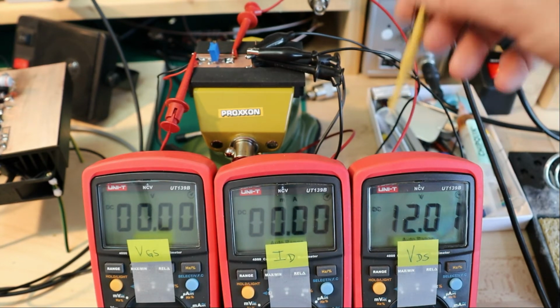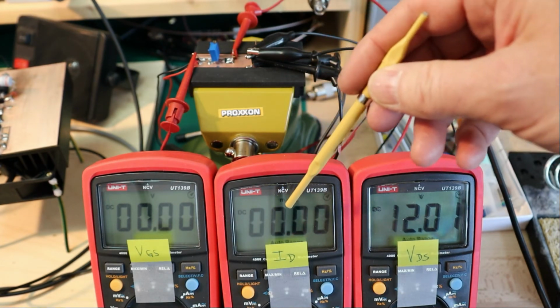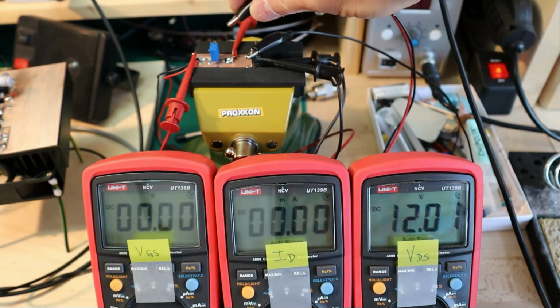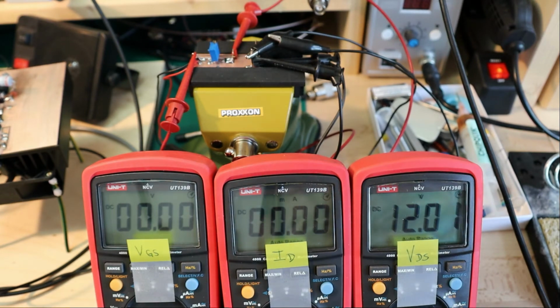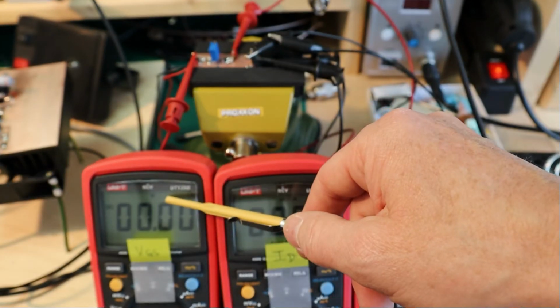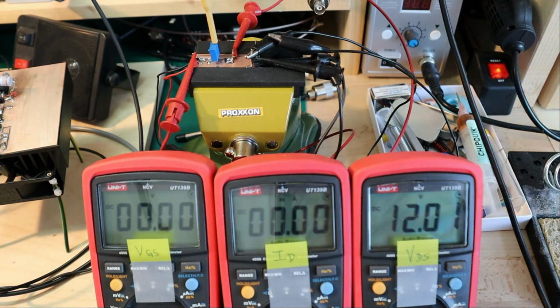I just quickly turn on and immediately have to turn off again, and we measure the maximum ID current, which is specified, I thought, somewhere between 24 to 60 milliamps. So let's see where this current goes. I quickly connect, and it goes to around 30-31 milliamps. Immediately it starts dropping because it heats up so quickly. So at 12 volt, VGS, the gate voltage, 0, we get about 30 milliamps. Let's see where we get if we increase the gate source voltage to minus 1.